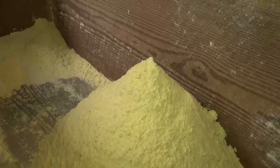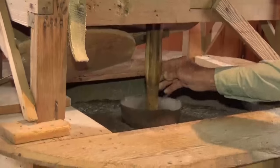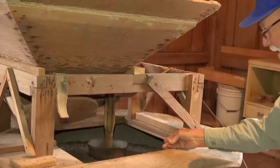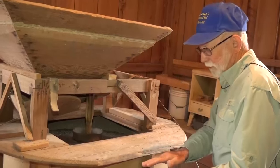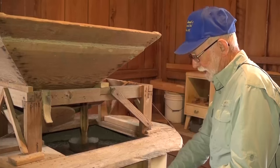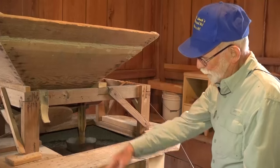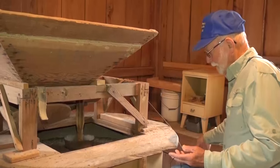I've shucked corn, I've ground corn. We even had a mill run — we sold meal to different stores and we delivered meal. On top of that saddle that the rock sits on is what we call a rattle staff. You'll see when I turn the water to it how this turns, and it makes this shaker bump, and the corn falls out and gets between the rocks. There are grooves cut in both surfaces of the rock — the top of the bottom rock and the bottom of the top rock. They're wider in the center and work out shallow at the edge so the corn, as it grinds into meal, works out to the edge. Then you put a hoop around it to catch it, cut a hole in one side, and as the rock turns, it makes the meal come out and you catch it in the box down there.